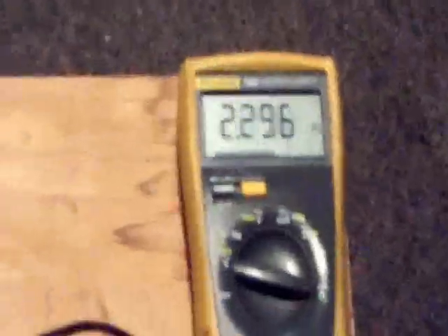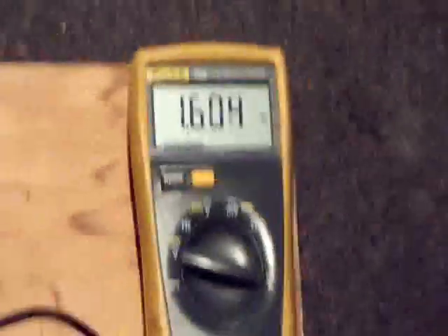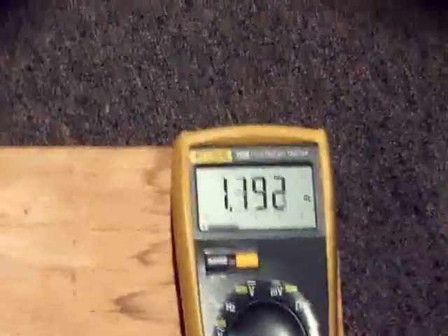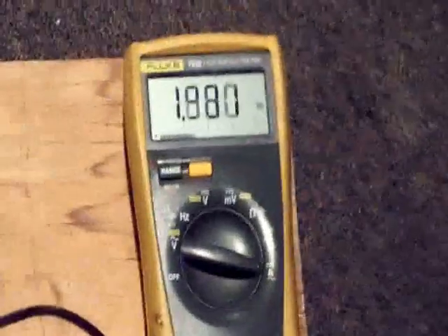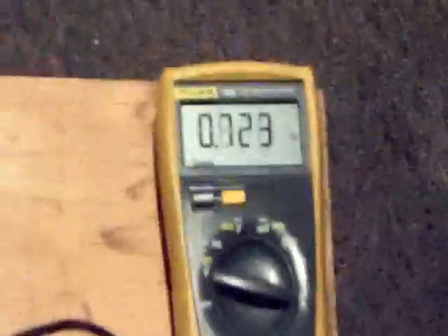I can go about 20 minutes here, no problem. Once I'm done I've put energy back into the batteries. The load that I'm powering is very small — around 20 watts or so — powering a CFL compact fluorescent. That 20 watts will run for about 7 hours or so, or you can pedal longer and get more run time out of your batteries.